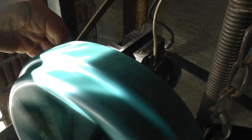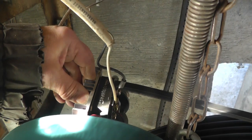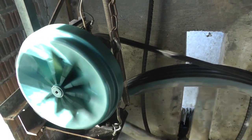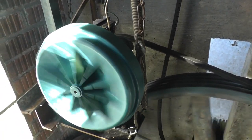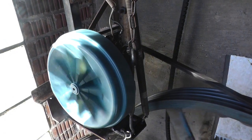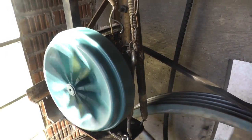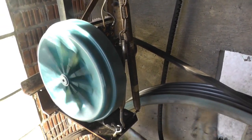Let's see if we got any heat lumps at all — nope. Of course it's only maybe 30 to 32 degrees. Can't feel any heat. So let me put the camera down and throw that belt on the other one and see if we can add anything with the second generator. Threw the other belt on, added the other generator in, and of course it slowed down the water wheel a little bit and wound up making the same amount.